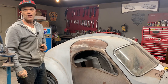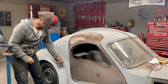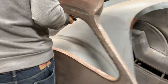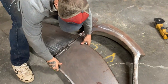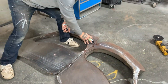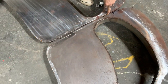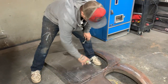I learned that on the cider truck — you cannot put two hinges on a circle door. It has to be on a flat. So I first marked it up top, then marked it down below. I brought the other door down, laid them together, and lined the backbones up, trying to make it as straight as possible. I had my hinge up high at first — that would not have worked. I laid the hinge on there, found where it's flat, and those two points are where my hinges are going to go. That's the flattest place. Before or after that it starts gapping.